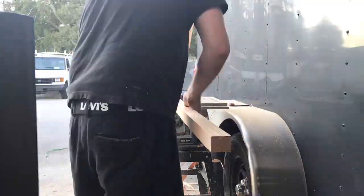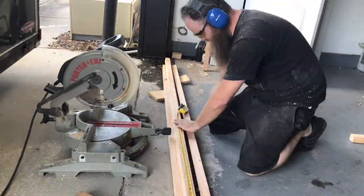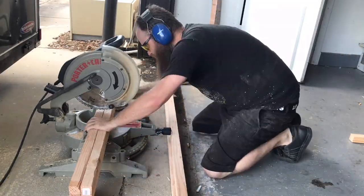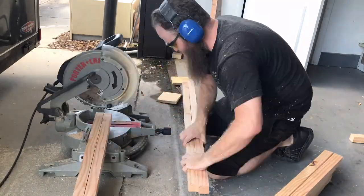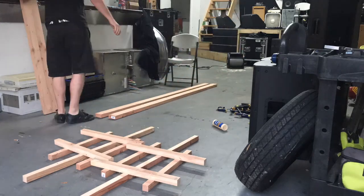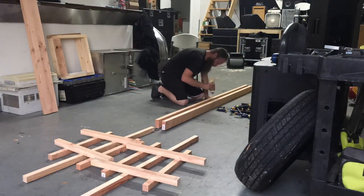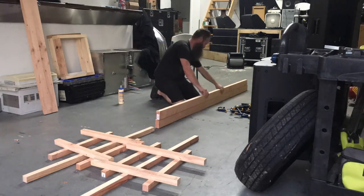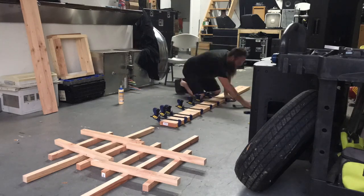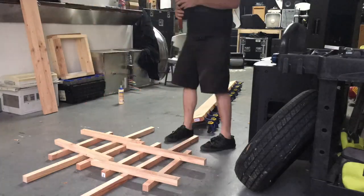This is me cutting down two-by-fours into basically two-by-twos. There's gonna be all the little decorative pieces on the top and the sides — just trimming those down. I cut a bunch at once and you can see I kind of mocked up the side design there. I'm taking the two two-by-fours on each side, cutting off the edges so they're flat, and then combining those into basically a two-by-eight, gluing those together.